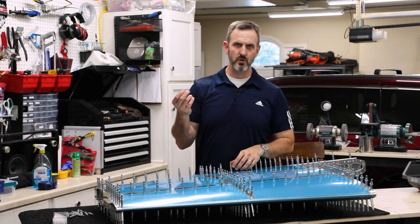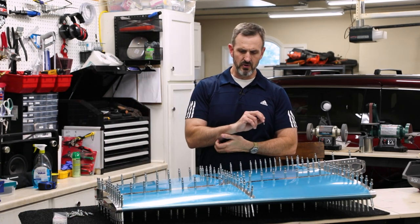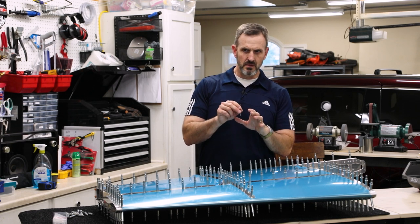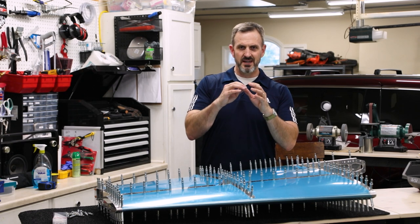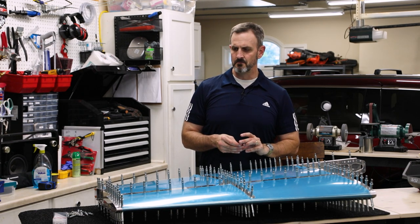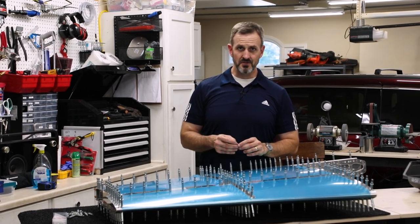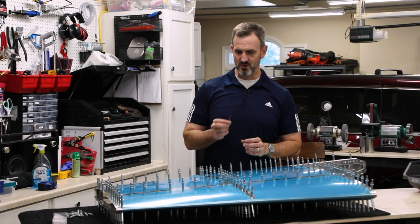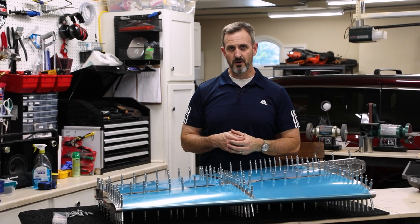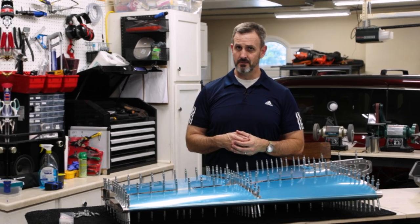So one thing that I found is that if you get a size 30 drill bit or 40, depending on the size of the hole, you can push it in the hole and then wiggle it, and it'll realign everything. And I think that'll be useful for later. Anyway, just a little tip. I think I might have solved what could have been a potential problem for later. So anyway, I'm going to take the sucker apart and get everything ready for priming.